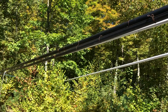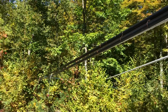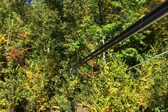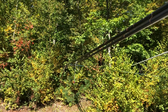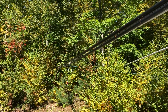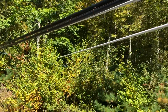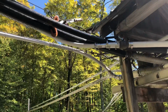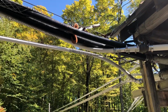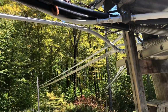that's 1.5 inches over 2 inch. That's buried, goes in the ground over there, about 200 feet from here, and it goes 5,000 feet buried under the ground to a little over 4,000 taps. So that works well. I haven't seen much vacuum loss on that. As I said, the 1.5 inches is full, and it stays pretty clean. I really don't have any issues.